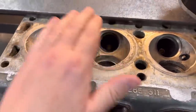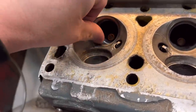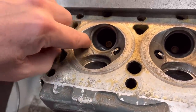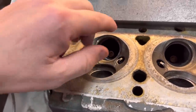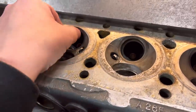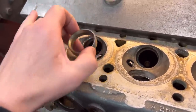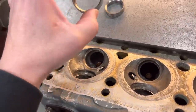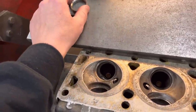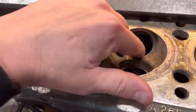We've set this cylinder head up here and we've got to put new valve seat inserts in. The reason is these seats have become a bit pocketed — the valves have eaten into the seat — and because of this quite steep angle of the combustion chamber, by the time we've cut those seats they're going to be buried down the hole, so the customer wants new ones put in. We normally remove the old ones and order an insert slightly bigger than the existing hole, but on this occasion these are the exact original inserts already in this head. We've got to make sure we don't cut outside the outside diameter of these inserts, otherwise the hole is going to be too big.